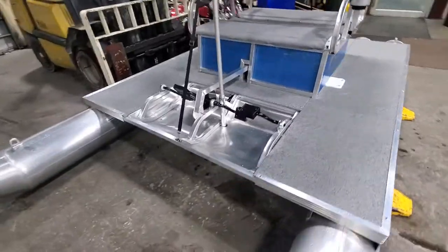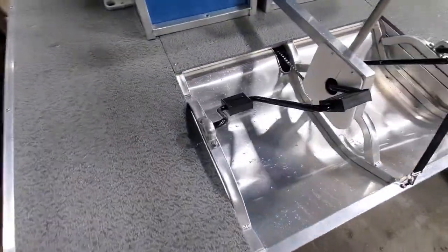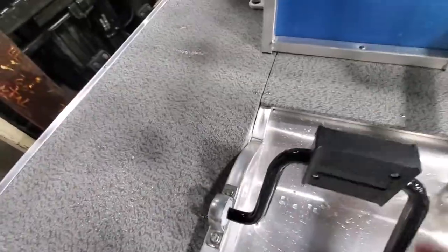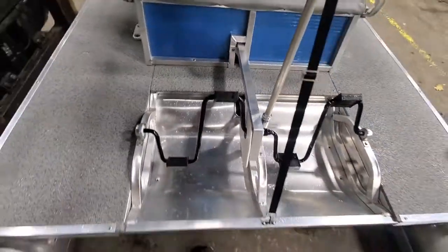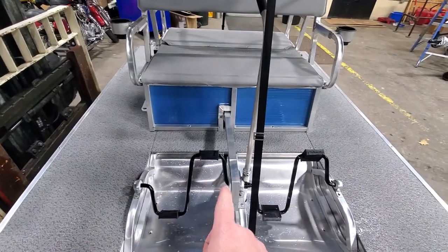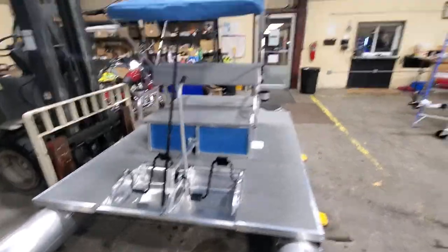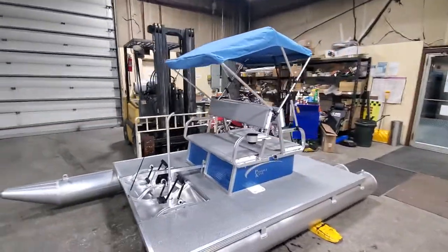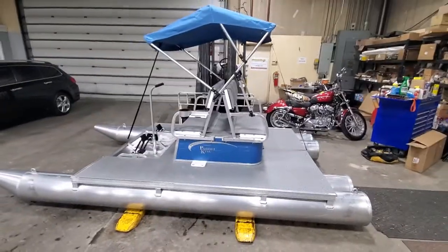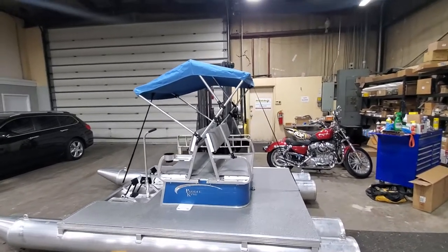I just washed the boat and got everything cleaned up — there's a little bit of white lithium grease there. On this mechanism there are three bushings underneath the housing and three bushings exposed in front of the housing. I use white lithium grease, and that's important to note because it does not react with UV rays or petroleum distillates to break down the nylon bushing. If you use a standard oil, over time it can break that nylon down.